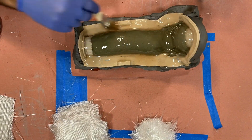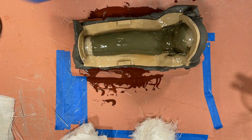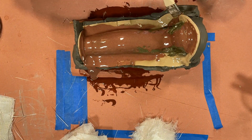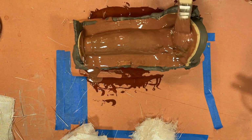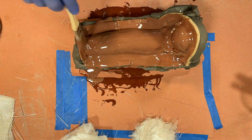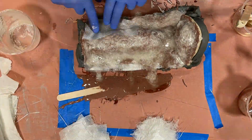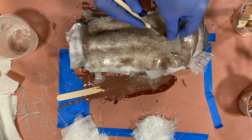My first test with the foam latex skin was really hard on the skins, and I want a silicone skin, which is generally more durable than the foam latex. Because I'm choosing silicone, I'm going to have to make an epoxy mold. And this here is a time lapse of just one part of that mold. The main body was 3 parts and the extra tentacles were a 2-piece mold. So I needed to make that mold a little bit more durable.